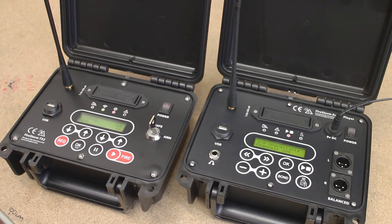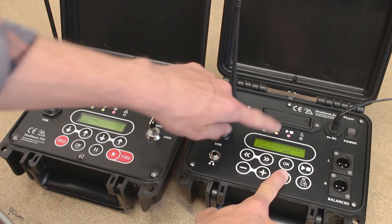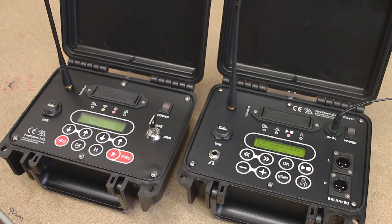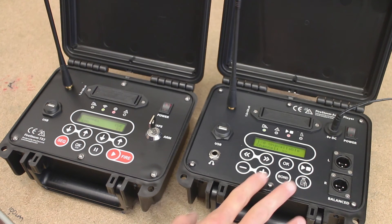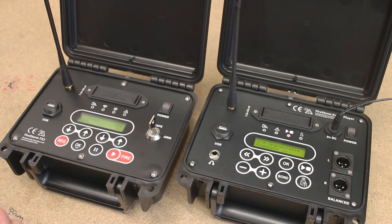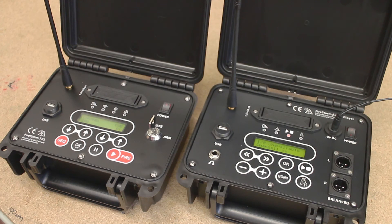Once again I'm going to clear these both and re-bond so you know exactly what to do. Press and hold the Bond button on the audio player — the Bond light is going to come on, keep holding the button and after a few seconds the light will go out, the channel will be cleared, and you've now cleared all bonding information from the audio player. Much the same on the TX2 — press and hold the OK button, the display will show Clearing, and then the unit has been cleared. Notice that the signal light and the continuity light have gone out because the link has been broken.